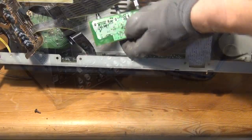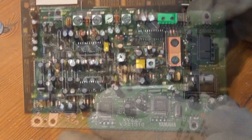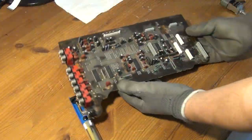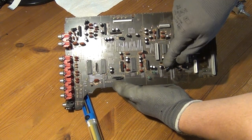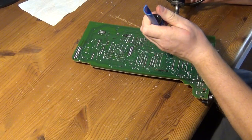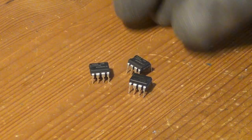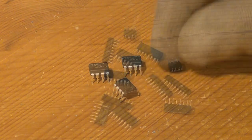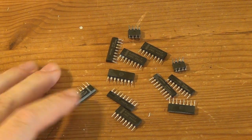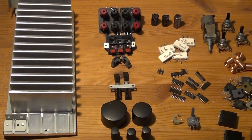After taking care of the power amplifier I tore down the rest of the device — took out the tuner, the DSP module, another board with all the switches, and the boards with all the RCA connectors. I went on to desolder more interesting parts like a bunch of potentiometers and a whole range of op-amps for future projects. Interestingly, a lot of these Japanese devices have operational amplifiers in single inline packages, something you basically never see in German audio equipment. Here's an overview of the parts I consider important for the project I have in mind.